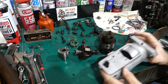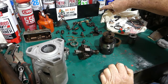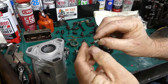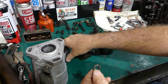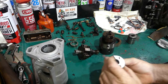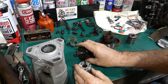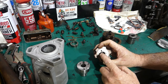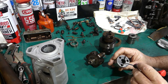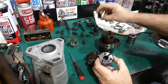We can get the pump body now. There's a flat washer with flat sides so it can fit down where the master spline is and kick sideways. That stays down there and pulls tight against the end of the shaft — make sure you put that in first. Then the funny spring washer, and then the bolt that holds it all together.